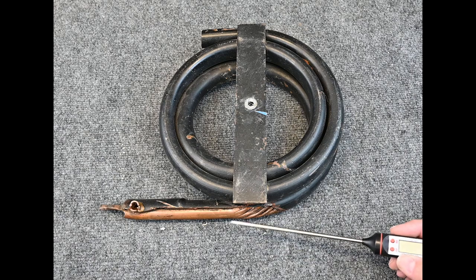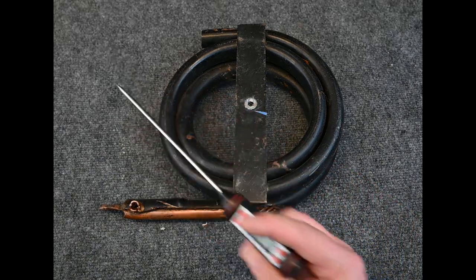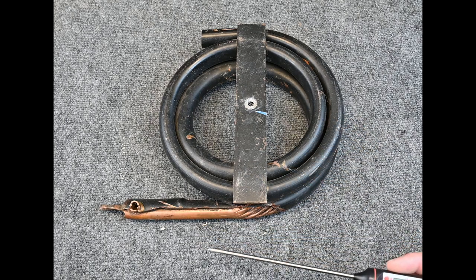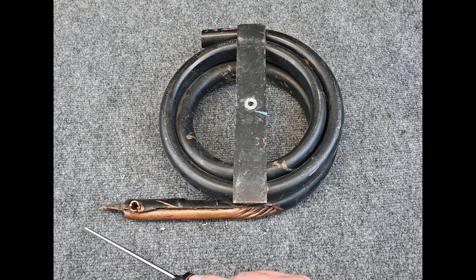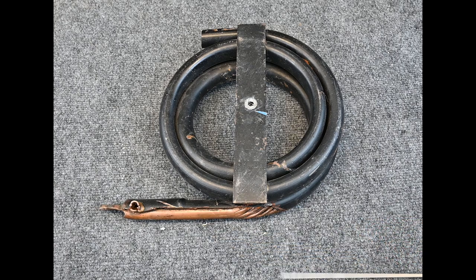And what I can do is I can absorb heat out of the water, and the cooler water leaves and goes, let's say, through a bunch of tubes inside of the earth. So the earth heats that water back up. And then as that water comes back over here, I use my refrigerant to absorb the heat out of water. I can then put that heat into the house.